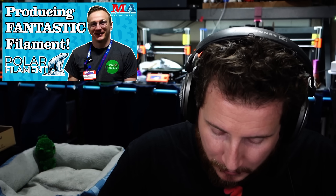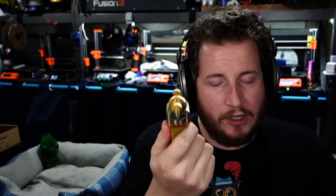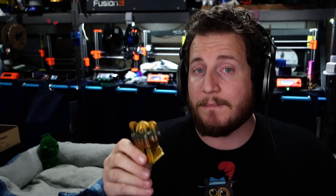Some of the colors I really like but have issues like this. Myself and Mitch from Polar Filament have talked about this in a podcast — not all filament is created equal. You end up with polymer mixes that are different from what you're expecting. Even though this material should perform like any other silk, it doesn't. I was quite frustrated when trying to deal with that, because when you print silk filaments that cold, they have zero strength whatsoever. Even after drying the two spools that I had, it still had that problem. I'm using the E3D High Flow Obsidian.